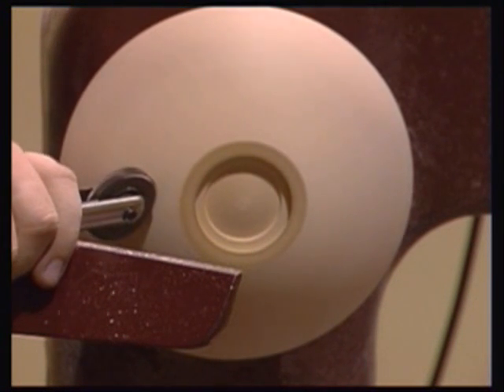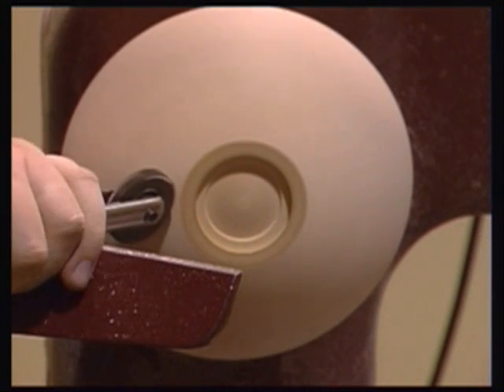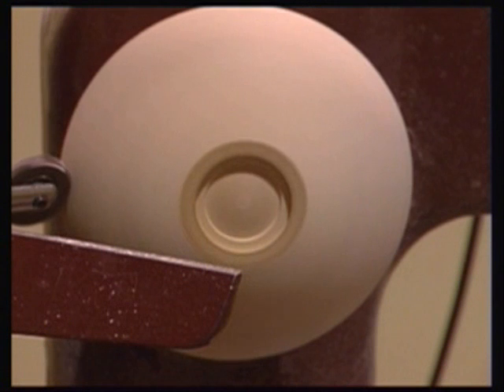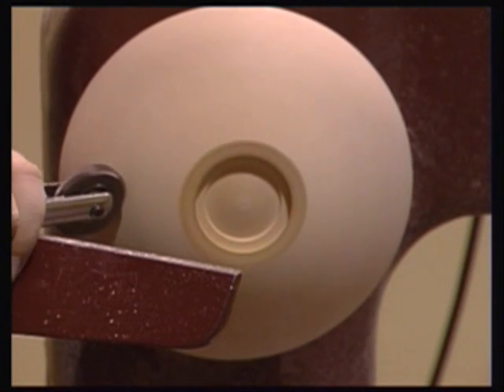On this occasion, the tool is held with a small degree of tilt to the cutter, so it is held at around a 20 degree angle. This degree of tilt is not critical, but the more the tool is opened out, the heavier and more aggressive the cut becomes, and this is worth bearing in mind if using a softer species of wood.